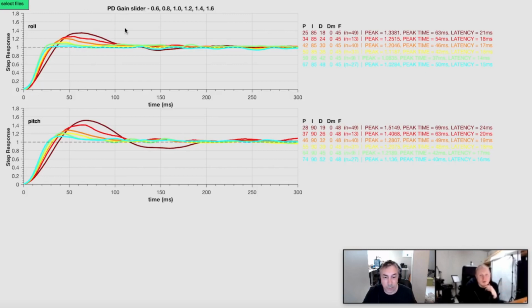But okay, so you can't go forever. First, it doesn't make sense because you get diminishing latency results, so it doesn't make sense to go further. And there's a risk that you get issues when D is too high. It's not optimal if you have to sacrifice an optimal tune because of some kind of problem with a frame, or some kind of feedback, or the flight controller not being properly mounted or something like that, right? It sucks. You shouldn't get too many oscillations anyway if the filter tuning was done right, unless you have a different issue.